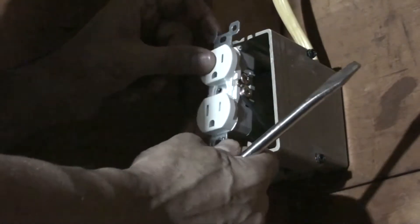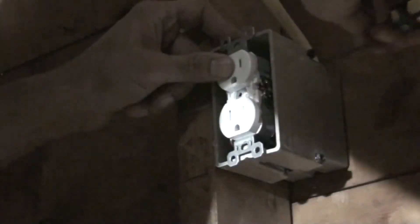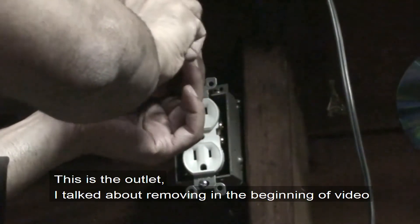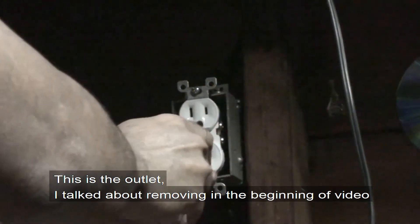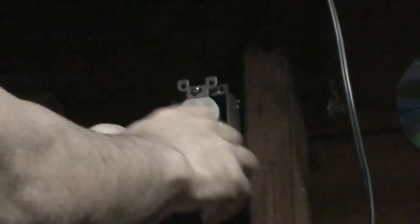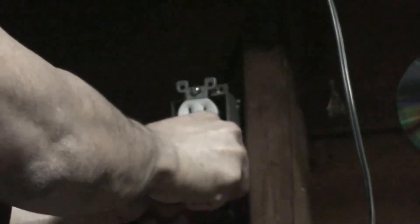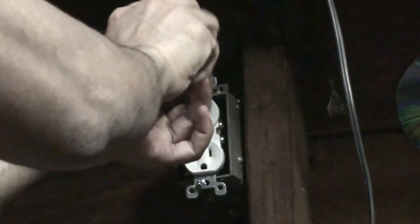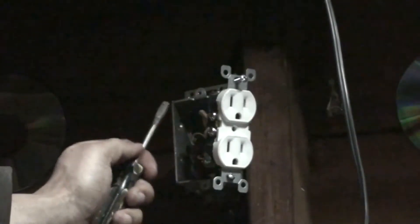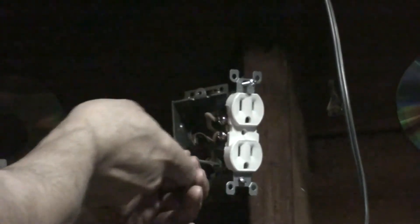The only other thing you need to do is put these screws in — looks like I don't have the screws for this. If the hole gets too big here, they might have some kind of sealant you can use to seal it. I actually shut down the power to this outlet and checked it to make sure there's no power, but I'm going to have to disconnect this outlet because I'm adding a new outlet and I can only have 10 15-amp outlets on one 20-amp circuit. I'm going to have to remove an outlet to add an outlet, and do that two more times because I'm adding two more outlets around the garage.